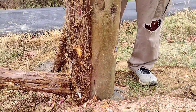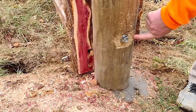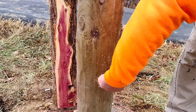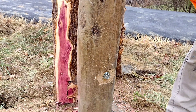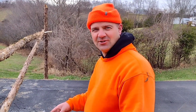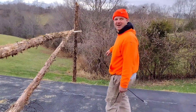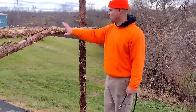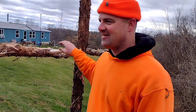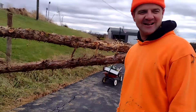Look at this — when it's closed, look at the fit; you see that? And then over here, I actually didn't want to pull the bolt all the way out, but I had to recess that bolt a little bit. So what I did is I used a hole saw, offset this way and then this way, and then I just chiseled that out so the washer fit in there. Anyways, we've got it braced, we've got it hung. I feel like it's a job well done for now. We will be back when I put the actuator on — that's the motorized gate opener. We'll come back once all the hardware is on. Is this too redneck or is this just the right amount? It's even got a handle — look at that. What are you going to put here? A wreath — yes, you know you're going to put a wreath on that, you Christmas-y lady. Alright, see ya.